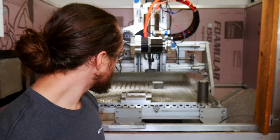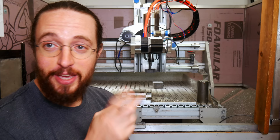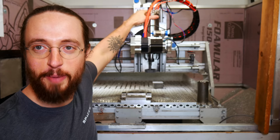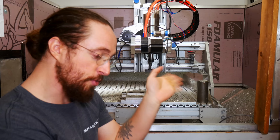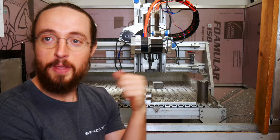One very important thing I want to say. The mathematics, as you can suspect, on doing a TCP control is pretty complex, and the coding is pretty complex, and I definitely did not do that. Mach 3 software, I was under the impression it would just work, and I ended up wasting money and time dealing with that, but it won't handle TCP at all.